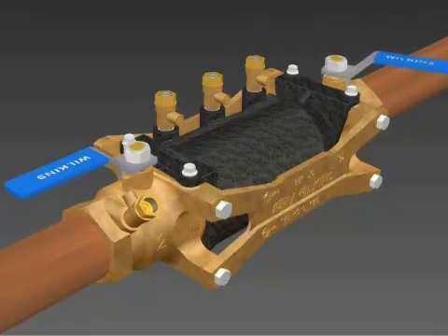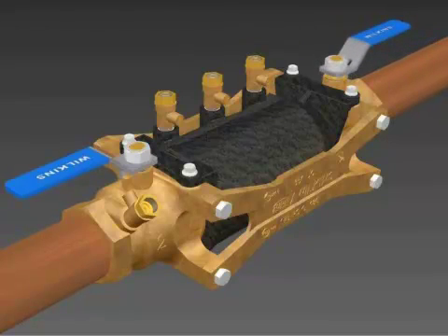Open your number one ball valve slowly to pressurize the valve and inspect for any leaks. Open the number two ball valve a small amount and wait for the system to pressurize. Fully open your ball valves once the system is pressurized.